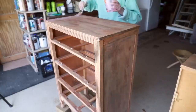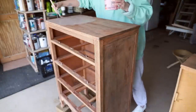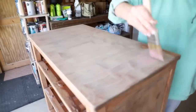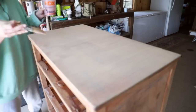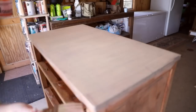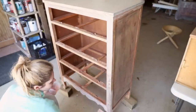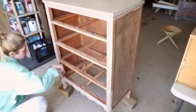I chose to do this because I had initially planned on a very high lacquered finish, so you really want the piece to be smooth for that. I'm not sure how well the camera picks it up, but you can see where a child at some point drew on the side of the dresser — that kind of stuff definitely got filled in. However, it did not completely fill in the wood grain — I may have watered it down too much. You can still see the wood grain, particularly on some of the drawers, not as much on the tops and sides. There's another product I ended up ordering but didn't use on this piece.